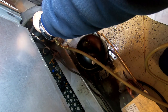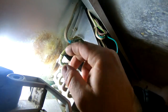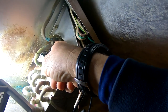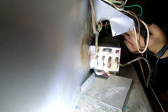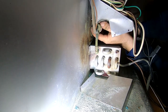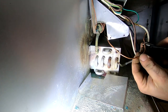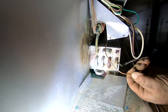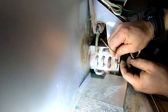Here we're purging out the suction line back towards the coil. I wrapped the capillary tube around the accumulator to help boil off any leftover refrigerant that's in the accumulator, then we'll bring it back around and stick it into the evaporator about two to three inches. That's a capillary tube cutter I used — it works really well.